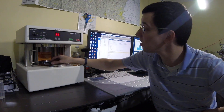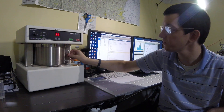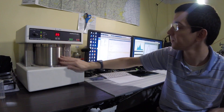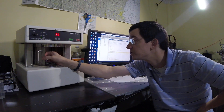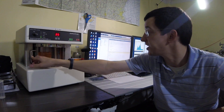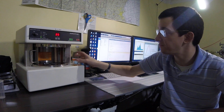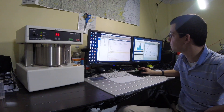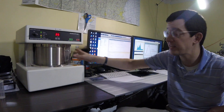We'll take the sample and put it on the sensor. This cabinet X-ray unit has a very convenient rotatable shield door. It also has an interlock system so once you close the door, the door-closed and ready light will come on. This unit will only go up to 35 keV, so a rather thin stainless steel door — about a sixteenth of an inch thick — will effectively screen out all X-rays at this particular energy. We'll close the system and program the exposure at 35 keV with a ten second exposure for the X-ray generator and a two second exposure on the camera.